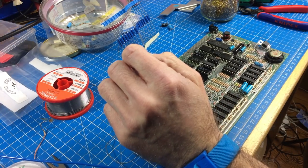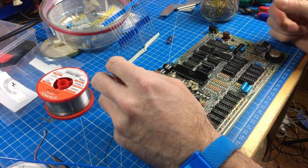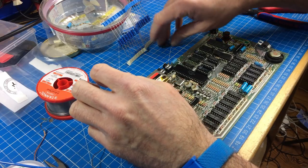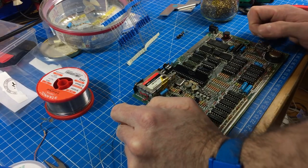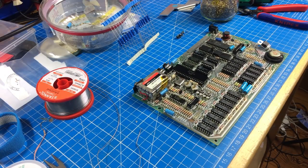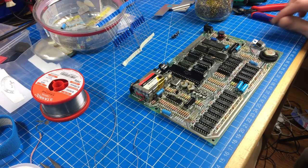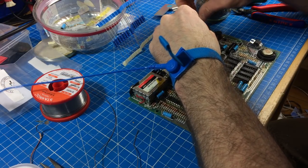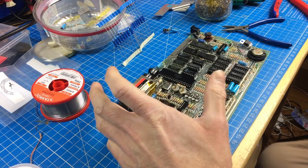Here's a little bodge that was added at some point - a mod to make up for power supply issues these early boards had. They added a 4.7 microfarad capacitor connected to resistor R58, from C34 which we just replaced. So we're going to find a 4.7 microfarad one and place it in there - going with a Panasonic one, which is also a pretty good brand. My bodge looks better than the bodge before, I think.